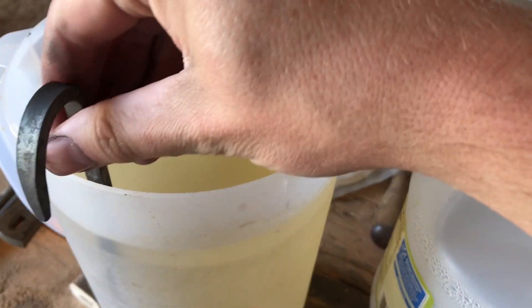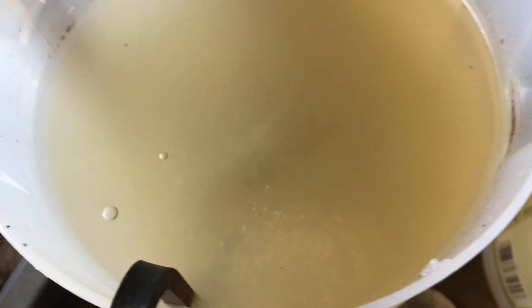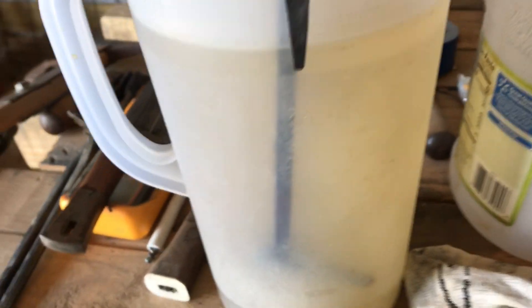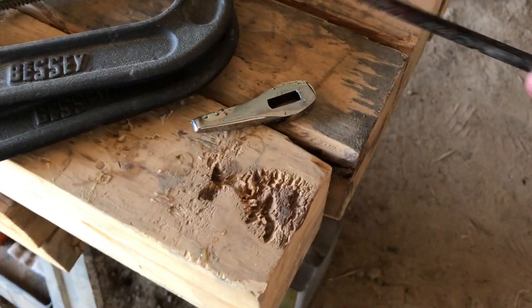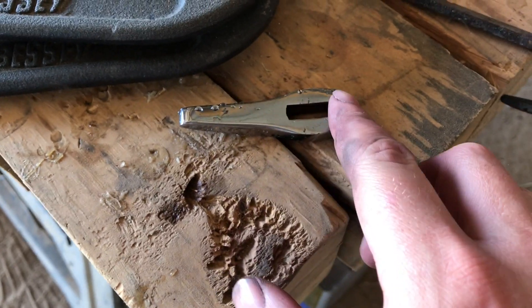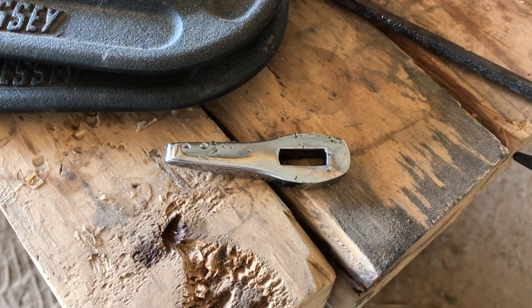You just have to hang it on there. You can start it before the vinegar's hot — I just like to get the vinegar hot so the chemical reaction will happen faster. You'll start to see it kind of bubble. You really, really should degrease it before you put it in there, because if you have any fingerprints or buffing compound on there, it obviously won't eat through that. It's not strong enough, so we're going to degrease it.